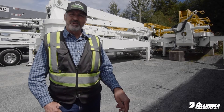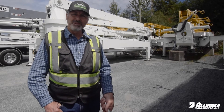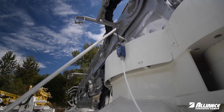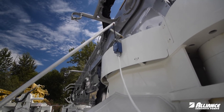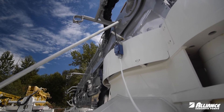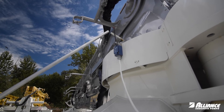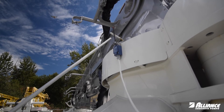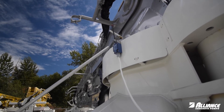if you've got a long stick or a probe, here's a little trick to try and get it working again quickly. This is the boom limit switch and it controls how the boom stops and parks. If you can reach up here and just gently flick that arm a few times each way — this is parked right now — it'll often get you running again. This can happen if the switch gets sticky or has a problem.